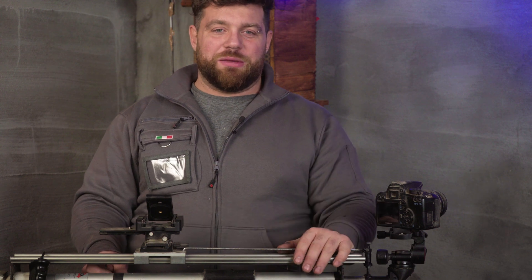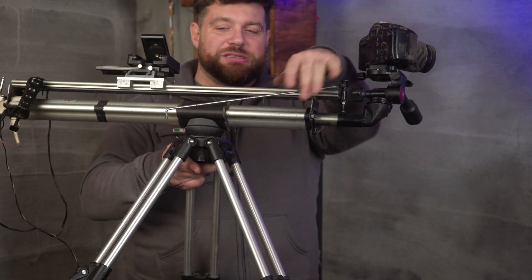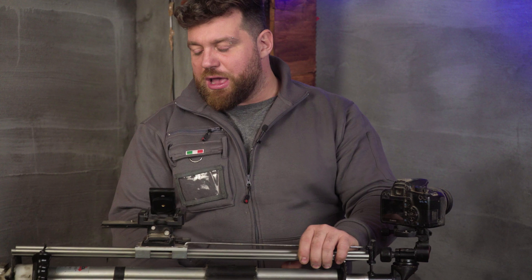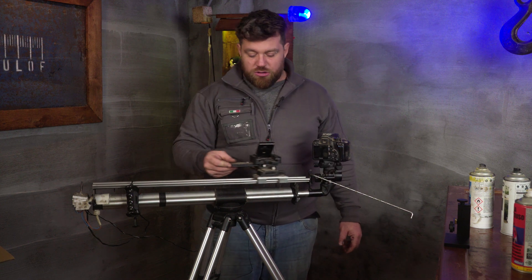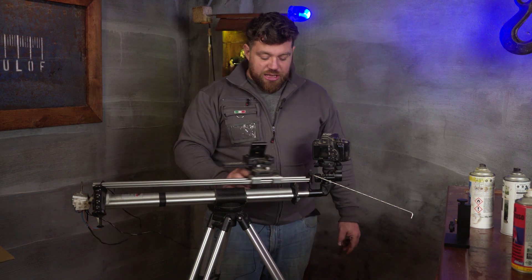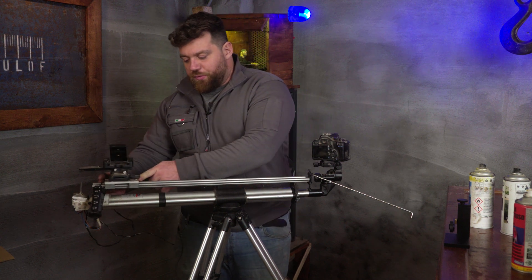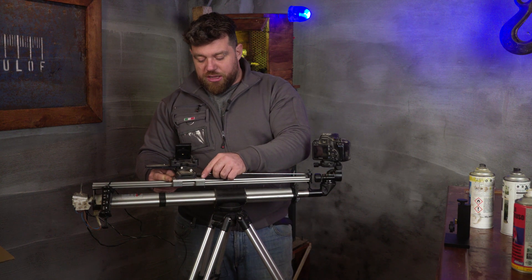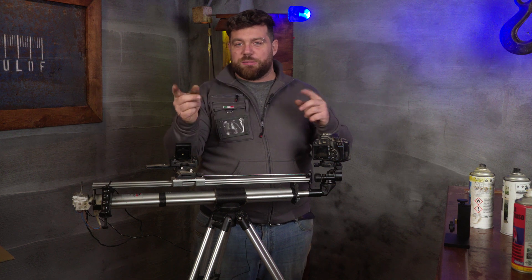I wasn't really sure how to connect the piston to the middle slider, but during the night I was dreaming and I had the solution just dreaming. I can use a stainless steel rod to connect the two parts together and you can see it slides without problems. The piston can extend 35cm but the middle slider can move within 60cm without problems using the hand. It could be a great idea to use a string and some pulleys to connect the motor and multiply the traction, but a simple rod solves all the problems with no issues — works smoothly and there are no vibrations.